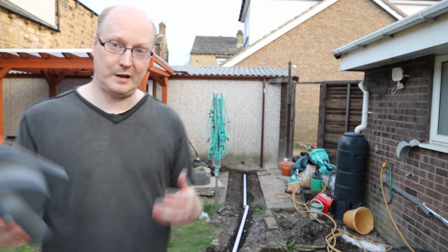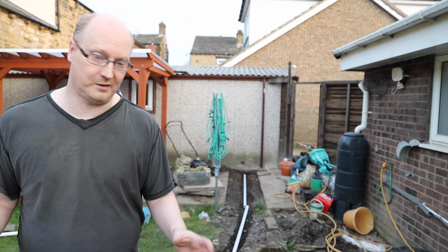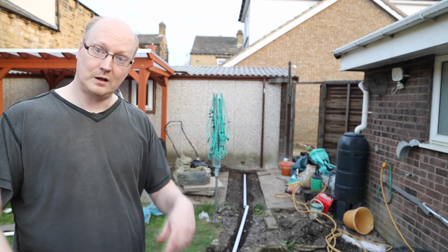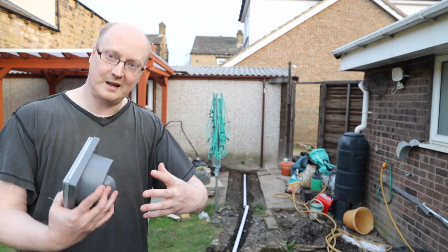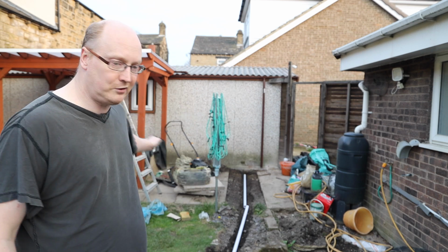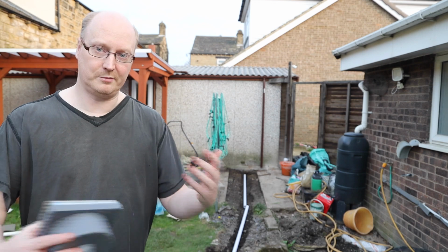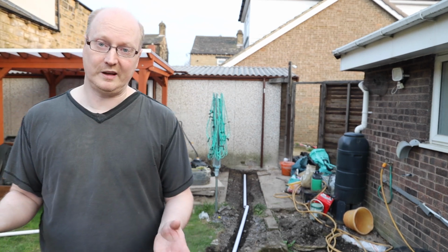So what you can do is have a sump pump system, which is basically your pipes go to a hole in the ground and takes your water. We can create what they call a French drain, which is essentially pipe with aggregate around it, and then some geotextile fabric material around to hold it together and keep the soil out of the system. And the sump pump is, like I said, a hole. You use an industrial pump, uncoil some cabling, connect it to your grey water drain and pump it out periodically, or you can get something automated. And obviously, that's one way of dealing with water that you want to get rid of.